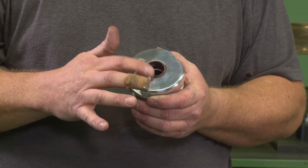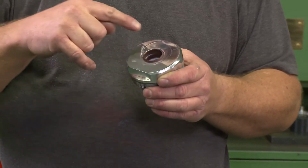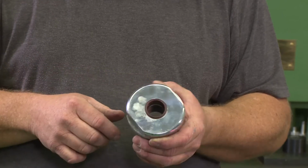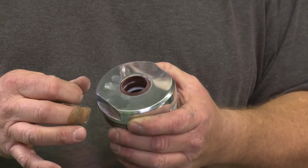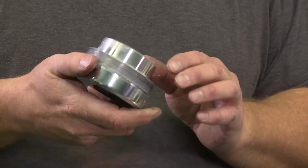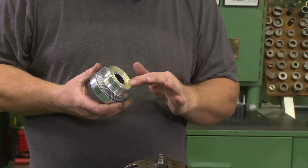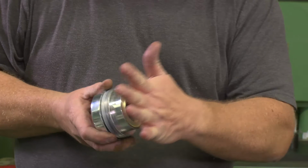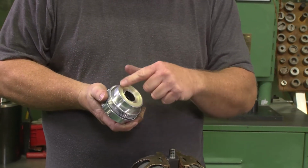This one is the wiper seal. The internal one that's in the second ring is actually a U-cup with the U facing into the cylinder. I don't know if you can see it. It's down inside, but the open side faces down into the cylinder. There's also a bumper on here, to keep them from mashing into the metal when the things come together. That's just a simple one that goes into the slot.